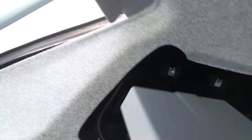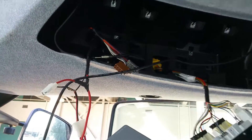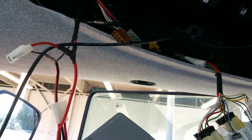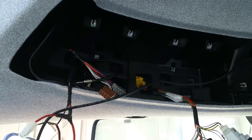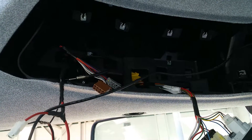Of course you use a PL-259 connector and crimp it properly. Then fit everything back in — there are screws to hold the control panel. It's an easy job once you've watched it, and if you're doing a couple of these a day you get pretty comfortable with it.